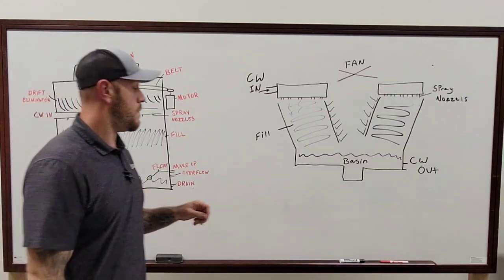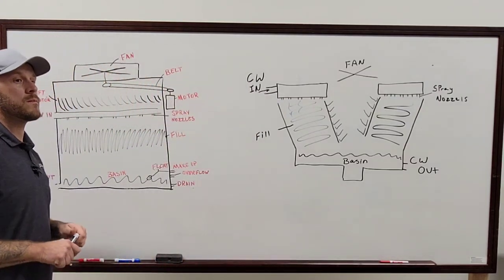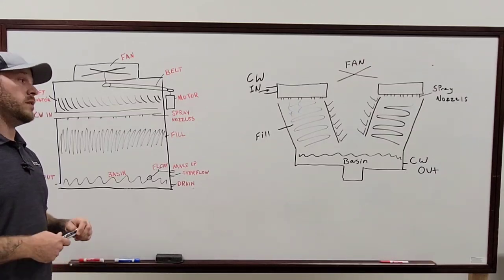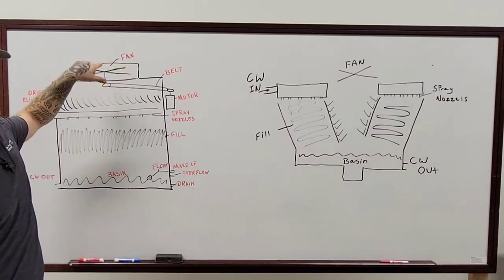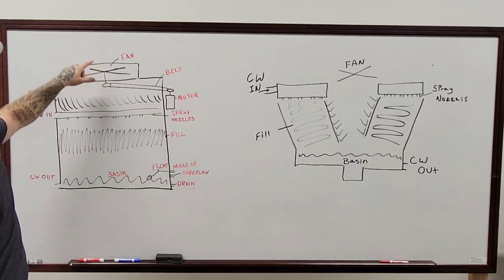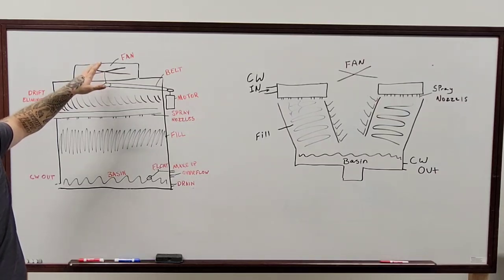So in your experience, when fan blades are off kilter or anything and they're hitting that shroud, is that more so caused by the bearings themselves or that beam going across? Well, if the fan blade itself is actually hitting that cone around the top, a lot of the times that is going to be that mechanical beam. Or if it's on a situation like this one, those pillow block bearings could have come loose on that shaft. There's all kinds of different things.